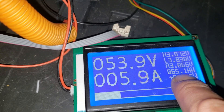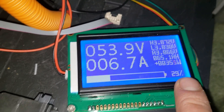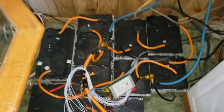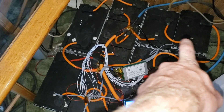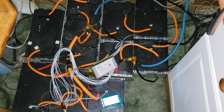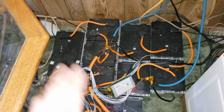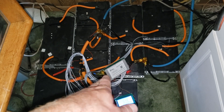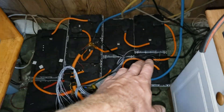We got 65 amps remaining. We're at 29% — I think that's a little bit high, we're probably close to like 20 or 19%. I got most of the bank hooked up to the BMS. I have this third hooked up; that third is not hooked up yet just because it takes time and I just did not have enough time, so I'll be doing that shortly. Everything's working good though. I have it set so it shuts the batteries off once it hits the low-level voltage, and that also saves these batteries because they're pretty well all balanced.